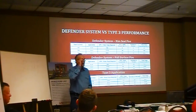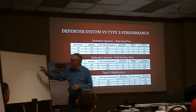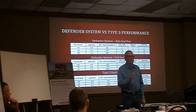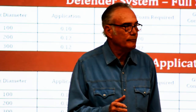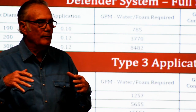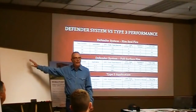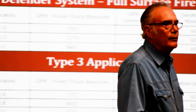If you have internal floaters, you need to get with Chris and Ride and talk to them about the package we've come up with to extinguish this. If you've got a head here, a head here, and a head on the opposite side, you'll kill them. How many of you don't think that twelve 350s inside a 120-foot diameter internal floater won't put it out? You need to shoot foam first to cool everything off so you don't blow the roof off. You've got about 45 to 50 minutes of foam. Then pull the trigger on the dry chemical — you will blow purple powder out of every orifice, and you'll probably be out. If you don't use dry powder, the chances are better than good you're not going to put it out.